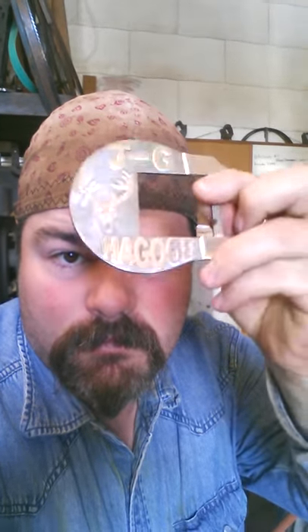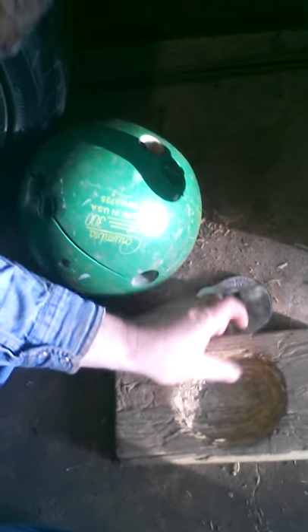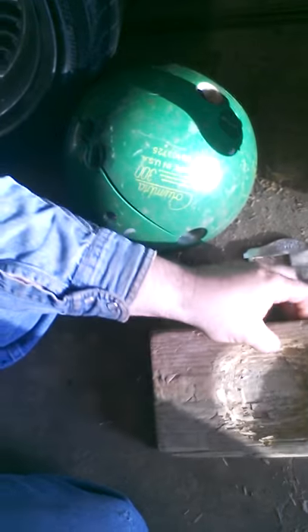I use high heat solder, so I put my silver on first. I put it on flat. That's what I got — my blank that I cut out. I put it upside down. I made this years ago; you can make it out of wood. It's just a doming block. I've beveled it out and domed it out.